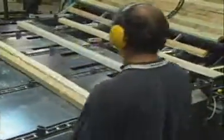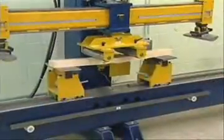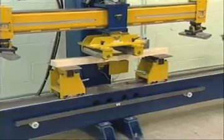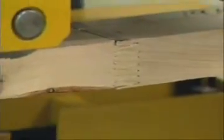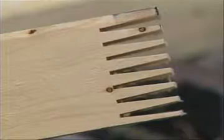More precisely, the daily quality control tests are as follows: for each hour of production, a finger joint is tested and each piece must meet the strength criteria set by the quality control program in order for the finger jointed lumber to be used in a structural application such as a scaffold plank. A weathering test is also performed on the finger joint to ensure that the glue lines are resistant to water.